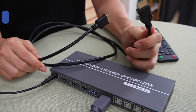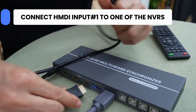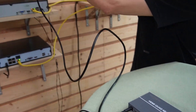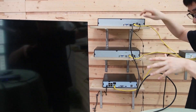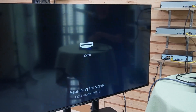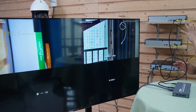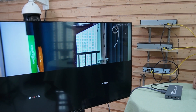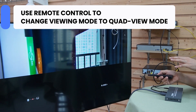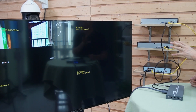I will use this HDMI cable to connect port number one to one of our network video recorders. Let me turn on the TV. This is the video source from the first network video recorder — it has taken the full screen. Using the remote control, we can change the viewing mode to quad mode. Now the TV is split into four windows.